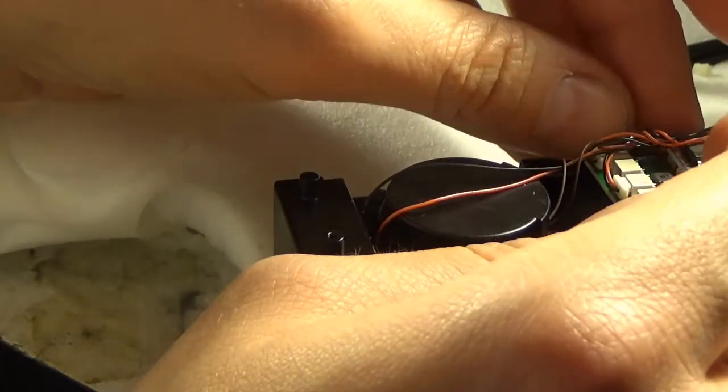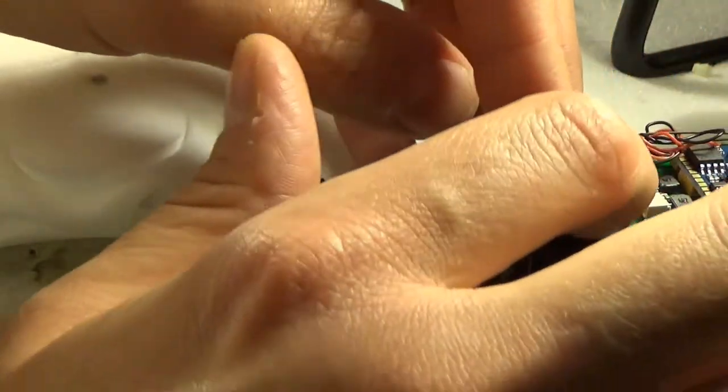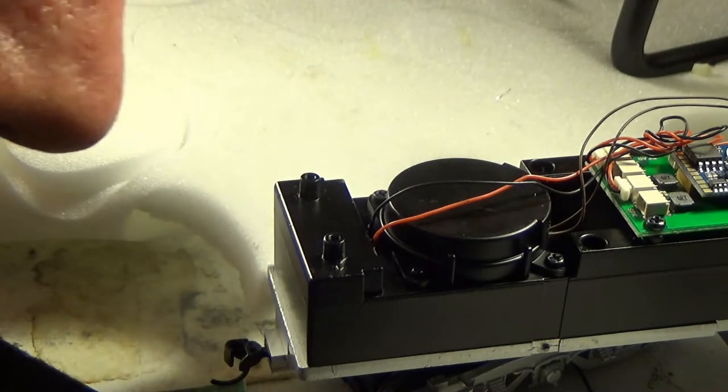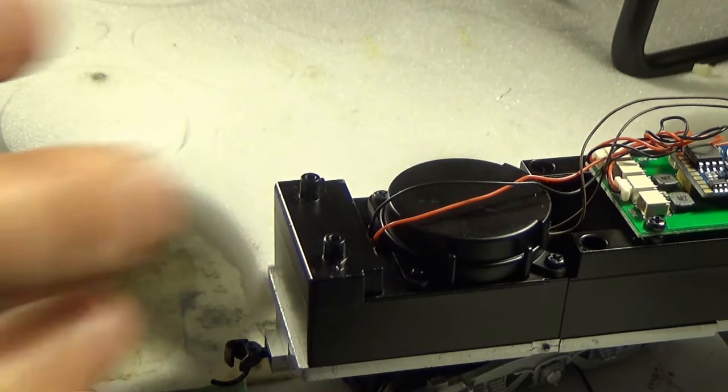With the screws nice and tight, I carefully checked to make sure all the wires were in the correct position. Again, it is critical that the speaker baffle be tight to get the best sound out of the speaker as possible. Then I broke out my test track to go ahead and test the decoder to see if it would function correctly.